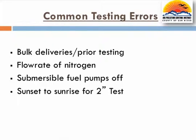The test shown in this video, TP96-1, can be conducted at any time of the day. This video gave an overview of the 10-inch pressure decay test as it applies to underground storage tanks. Testers should be aware that when testing above-ground storage tanks using TP96-1, the allowable decay is always 0.1 inches water column for 15 minutes regardless of ullage. The ullage must be at least 15% of the tank's capacity and no less than 300 gallons for tanks under 1,000 gallons capacity.